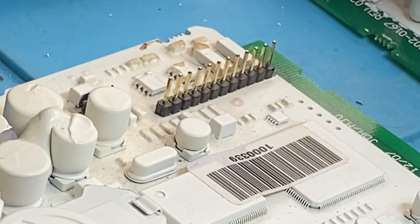Unless they pick it up further down the chain, they don't amplify so much at the start and amplify more later. You can also do it the other way around. You can amplify like hell at the input and amplify less later, but then there's a good chance that on very heavily mineralized ground, you're going to basically swamp your front end and your next stages, probably bang up your multiplexer, and everything will get noisy, with leakage and all sorts of stuff happening.